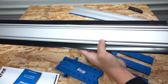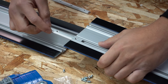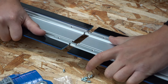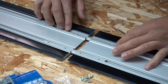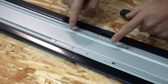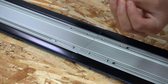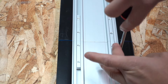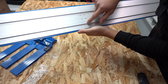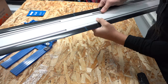Let's go and connect these two rails together. There are two arrow indicators so you know where to join them. Slide the bar in there, then slide the other bar in as well. Make sure that you push these two pieces together nice and tight, both slots even on each side. Now take your set screws and set them in place. There's a little bit of gap but that's perfectly okay — it's nice and aligned. Very sturdy.